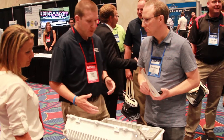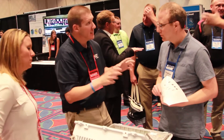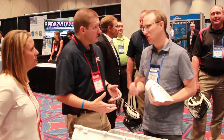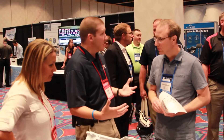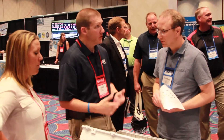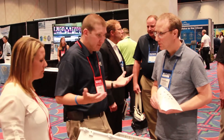Everybody's benefit is different. We own some systems in Wisconsin — lots of little cities with small CMTSs, but basically one CMTS total, and we'll need a second in about a year. You can get more density out of that CMTS with remote PHY in the field, plus performance benefits. That helps the operational side — brings your opex down if your guys aren't having to do as many truck rolls.